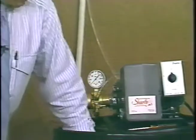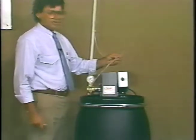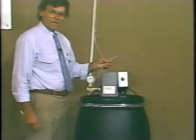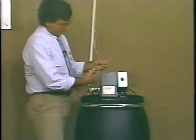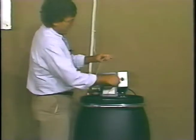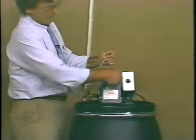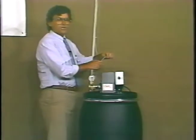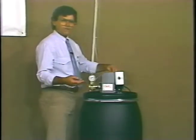and pushing the inside of your check valve to make sure that the check valve is opening properly. Once those two things are working properly, another potential problem — upon occasion, mice will cut through the line. They like to chew on the nylon and they'll cut through the line. So if your unit is running, you're picking up pressure and fluid out of the tank, and you can actually crimp this line and watch your pressure build up, but yet when you relieve this line you do not have anything coming out of your nozzles, then chances are a mouse or something has broken the line. Check for definite leaks within the line.